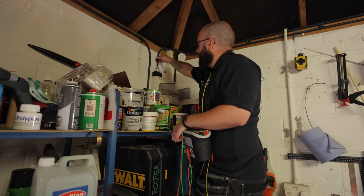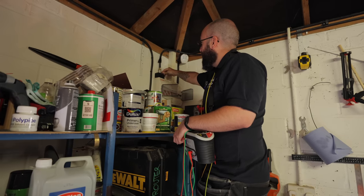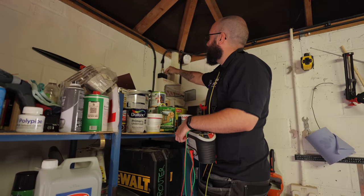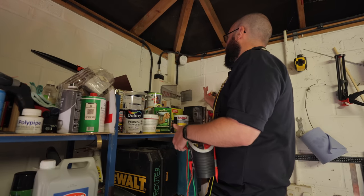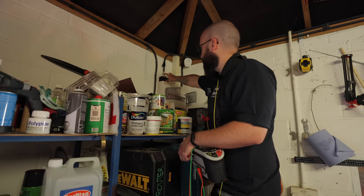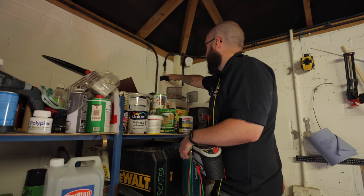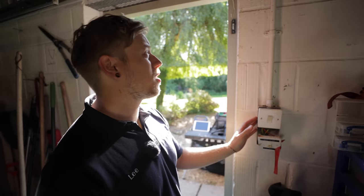There's a lot to be desired. They've had an SWA going into a coupler and then earthed it off a banjo in the middle of one of these coffin wagos — not really clever. A stop-end box would have been much better if they were going to gland it into something. I'll whip this cover off and see what we're up against.